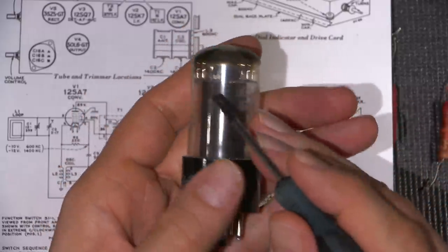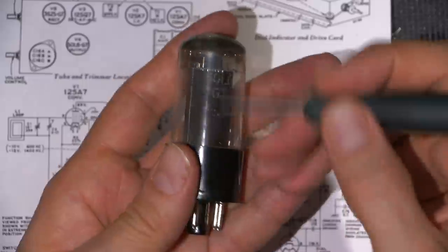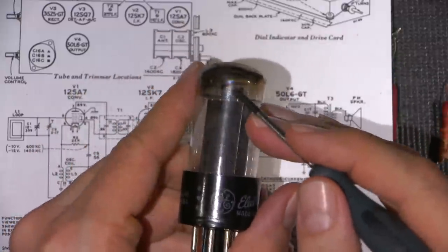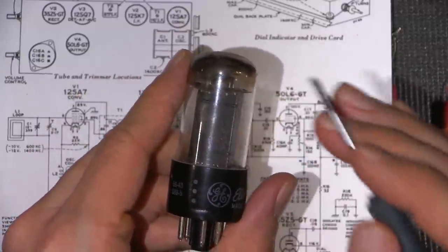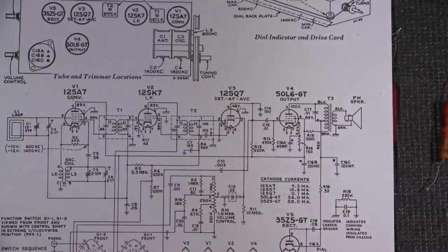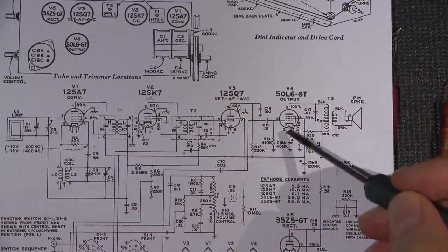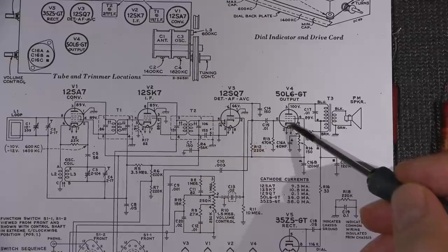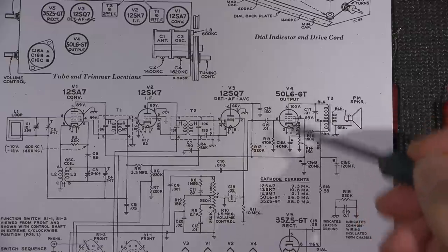The center part that glows in the tube is called the cathode, and that's where the filament is. So every tube glows, and that glow that we see is that very centerpiece. That is supposed to glow, that has to glow, or we won't have an electron flow. What happens is that glow is created by this little filament right here, and then that heats up this cathode. So this filament is inside of this pipe right here that runs right through the center of the tube,